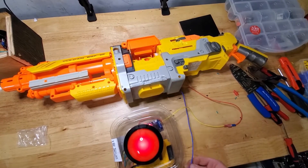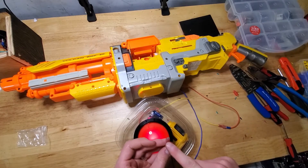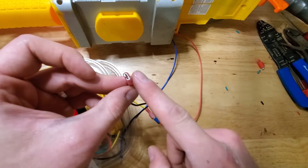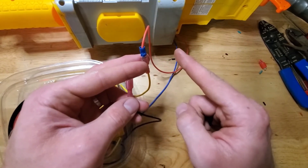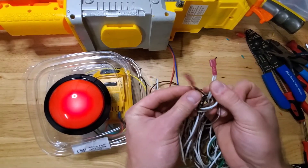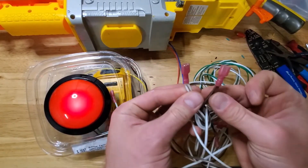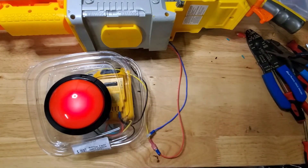If you wanted to connect more guns to the same machine, all you would do is have another wire coming off with the same end, over and over again — same with the power side. Each one would connect to a different gun. Here's my example of that: it's a big long cord where over and over again you've got the power and the ground. These are all wired in parallel, so everything is getting the full 20 volts from the battery. That's how I run four — you could run six or twelve if you had enough power.